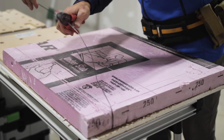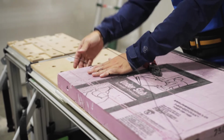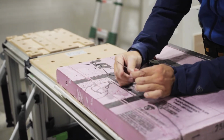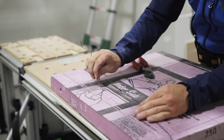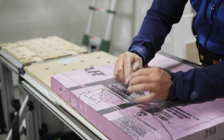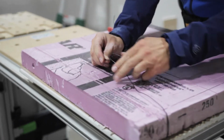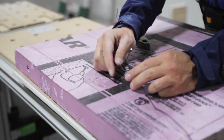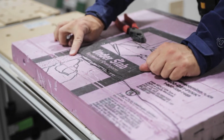Let's do it real quick. So I have another piece of wire here to this side, or just one big long piece, and cut it. And then when I come up in the center, you bend 90, 90. Okay? See how that's hooked? Don't get in the situation where you just bend one and then you want to spin this around this, because what happens? Pulls right out, right? It's like that with fishing string or anything. Make sure you're 90, okay? Because really that's all you have to do. It's never going to come apart.